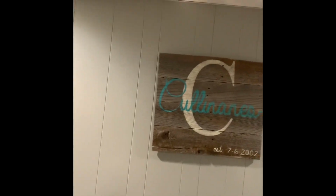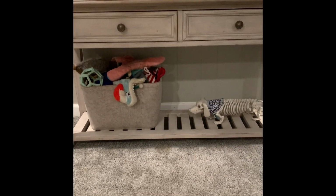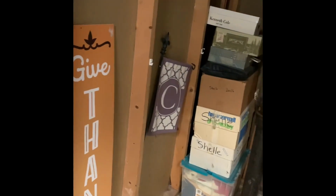All right, guys, so here's the insides. We're going to do a return grill right above that picture. We're going to do one down below there. We're going to have it centered on the wall, so between that door frame and that door frame there. And then we'll end up on the back side here, because that metal ends up kind of right where that stud is. So we'll have to put some support on the back side to support the grill on each side there. That's where our combustion grills will be.